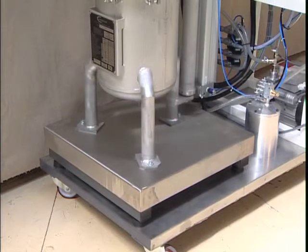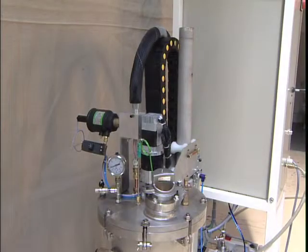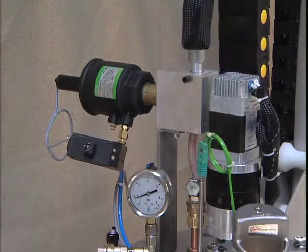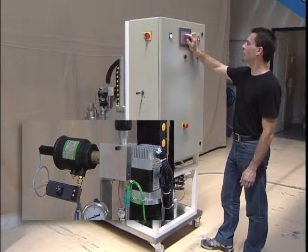The tank is placed on a precision balance that continuously measures the injected weight. Depending on this measured weight, the pinch valve automatically regulates the flow of resin injected throughout the whole injection phase. The user can also opt for single pressure injection by leaving the valve completely open.